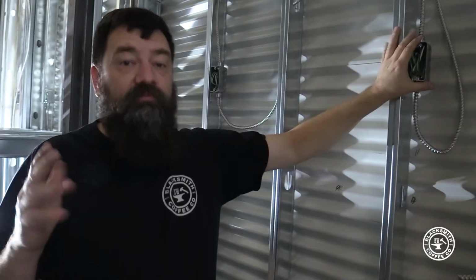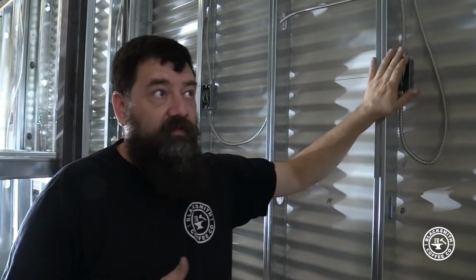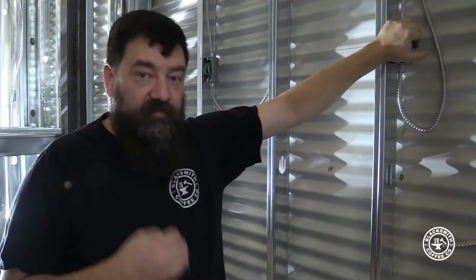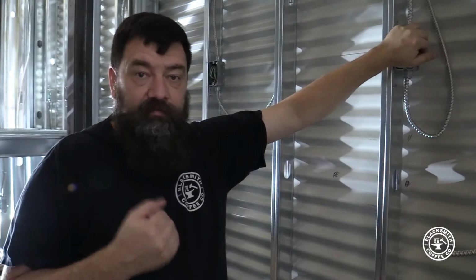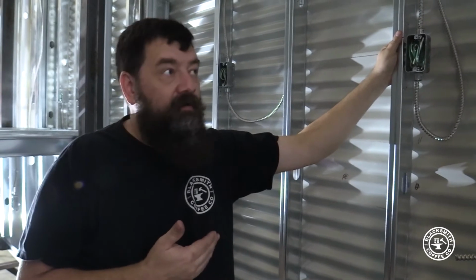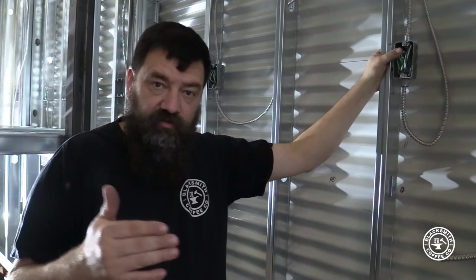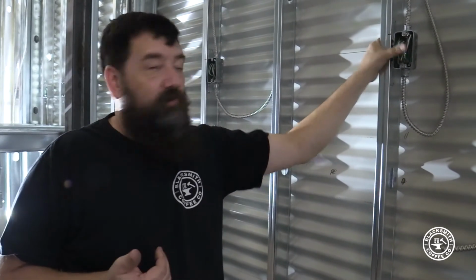And there's a few things that you should really be careful of if you don't know anything about electricity. Grounding is very important. As far as the finished project and safety of others, I don't think there's anything more important than seeing to it that you properly ground everything that you do in electricity. That's what will save people from touching something that isn't supposed to have power and having it have power. The next thing would probably be choosing the right size wire. Now we're going to talk not so much about electrocuting, we're talking about fire potential. Fire would be the wrong size wire.